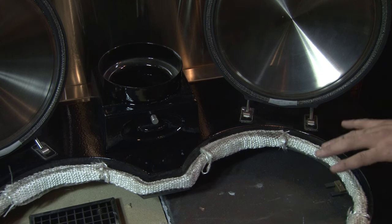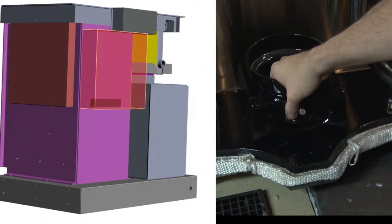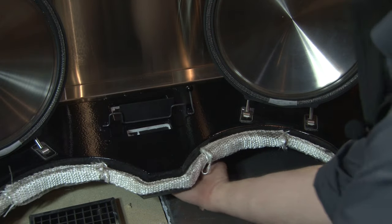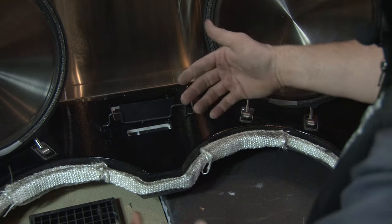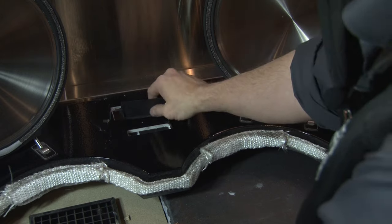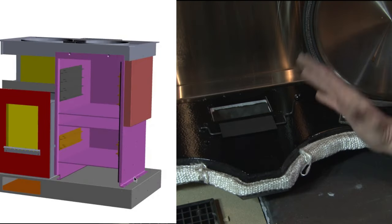Now that we've cleaned the right-hand side of the oven, the smoke travels underneath the oven and up the back. This is probably the most difficult part of cleaning the Esse stove. I'll quickly pull this apart and take the flue box cover off — this is our flue damper and this is how your Esse stove works. When you first light up, smoke comes out of the firebox and you're getting heat into the flue via the bypass damper. You sometimes hear a trickle-trickle noise, which is soot falling down into this gap. When it's hot, you push the damper forward, blocking that hole, which forces all the smoke across the top of the oven, down the side, underneath, and up through the flue.